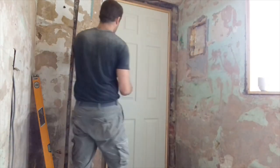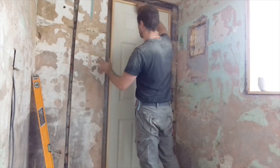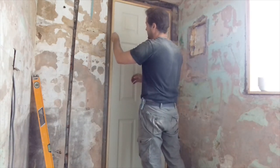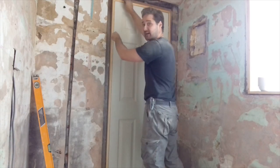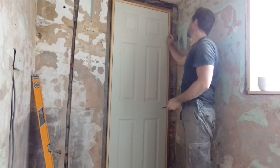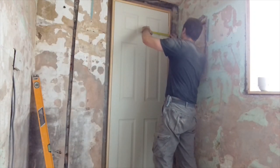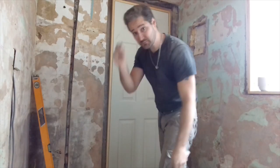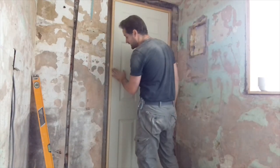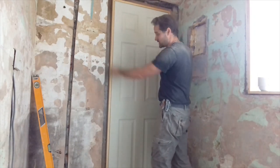So as you can see I'm actually planing the door down now. It doesn't have to be 100% spot on but it's best if it is because it looks nice when you've finished it. Now this side is tight here — I can't actually get my knife down there, it's that tight. But don't worry too much, because on this side there's loads of gap — I can almost get my pencil down there. I've got about a 7mm gap here, and that's because obviously the hinges are mounted on top of the wood, not buried within. So having it tight on this side is what you want, because once this is fixed in place, when you sink the actual hinges in you're going to have a nice beautiful gap down there.